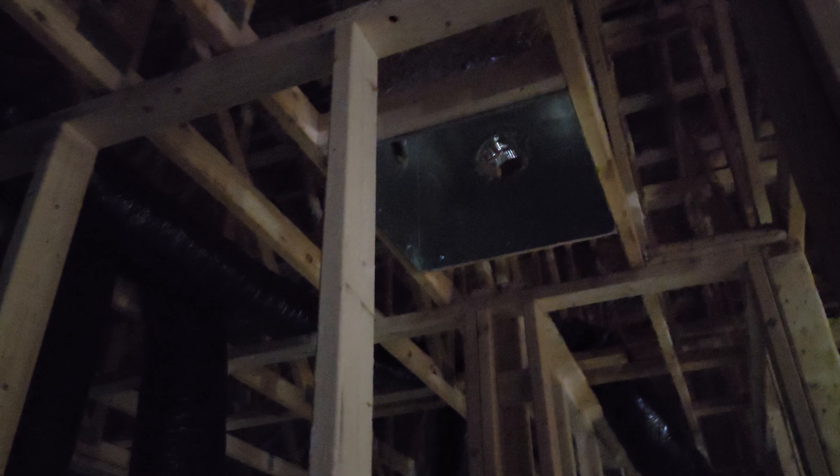Taking a quick video out here — they have pretty much run all of the HVAC pipes into all the rooms, and they are run back from the rooms and hanging down to where they go to the plenums, which is what this big gray box here is. That'll be where they supply these other rooms from. They'll take these big supply guys — 12, 14, looks like about an 18-inch — off of the furnace, and the furnace is already set. They'll come up to this box.